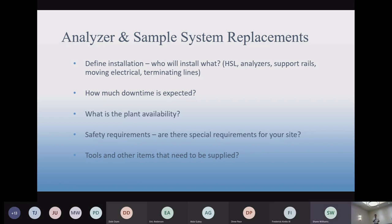Availability, that's another thing. I'm just curious about things like heated sample lines. Is there a shortage of supply on that these days too? Is that like everything else? We've been getting mostly Thermon lines and Tech Heaters, and thermal override occasionally. I'd say Tech Heaters is still on their standard schedule of about 5 weeks, and Thermon slipped for a while. They say they're getting back, we haven't quite seen it yet, but some lines are coming. I would give Thermon 8 weeks, fortunately, right now. They say they're hiring more people. The thing with them is it's not a supply thing as much, although they have had some supply issues. It's manpower; they've just ramped up their business and haven't been able to keep up. They keep saying they're hiring more people, it's going to turn around, so we'll see.